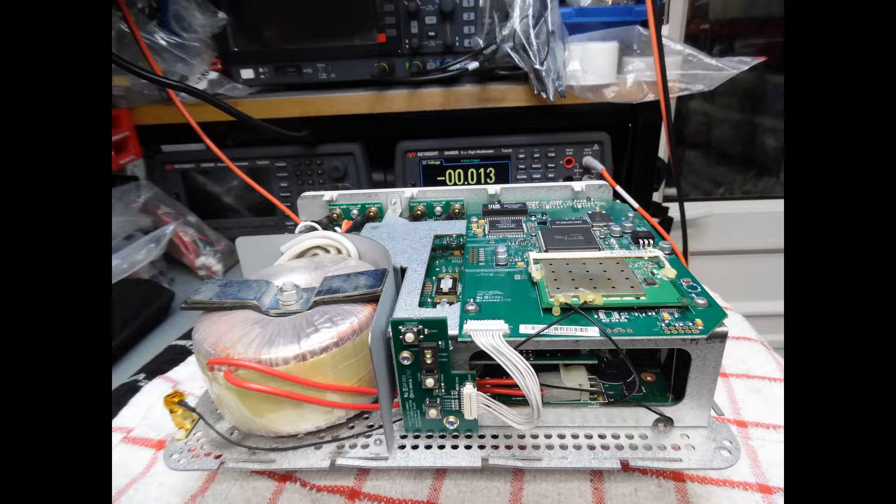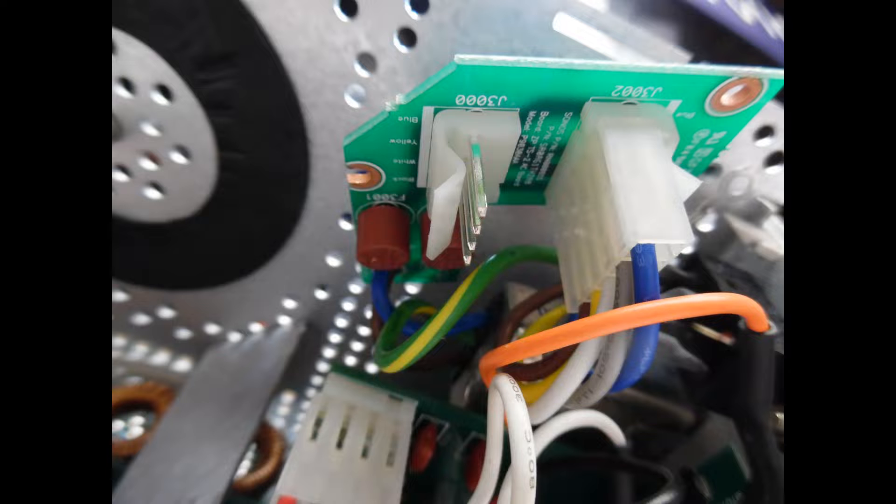Be very careful when removing the cover from the top — there are two aerials, so ensure you don't accidentally bend these. Place something underneath when turning the unit over to prevent damage. Because the unit didn't power up, that could be for multiple reasons. The initial investigation starts at the power input via the multi-pin socket — a figure-of-eight type lead — just verify you don't have any issues there. In this case there were none, and the next part is to get inside the unit. I'm drawing your attention to the input side of the power supply where you can see two Wickman-type fuses.